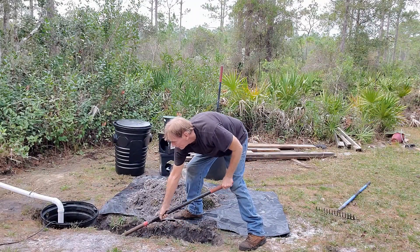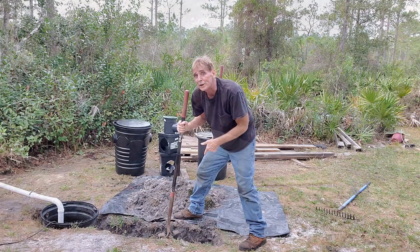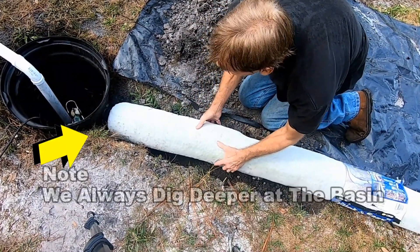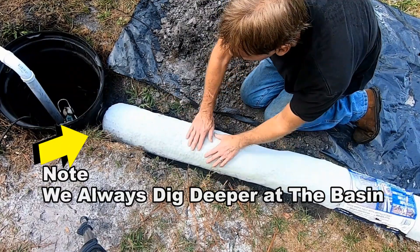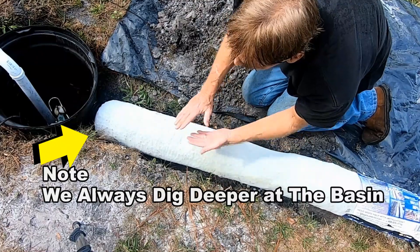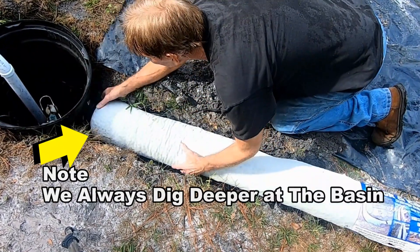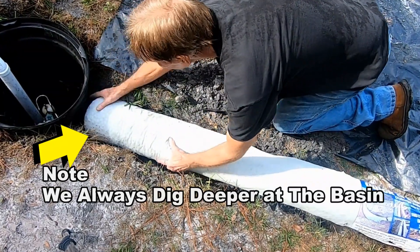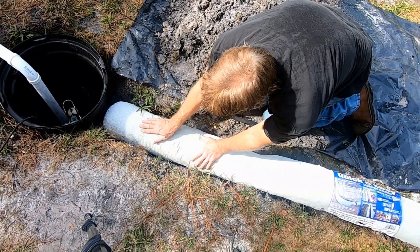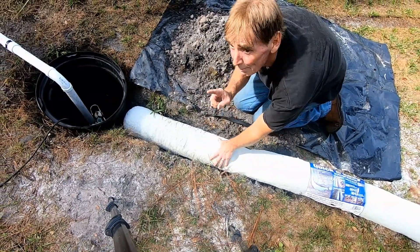Go right up to your discharge — in this case it is our sump pump. For the first example, I'm just going to use a piece of Easy Flow. This is a self-contained French drain; it's got fabric around it and it's totally wrapped in styrofoam peanuts, which serve as the gravel base on the bottom. Look — it slides right into our opening and it is at the perfect level for us to put dirt back on top and sod. That trench is absolutely perfect with one pass.